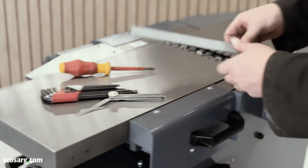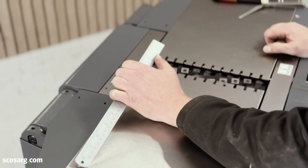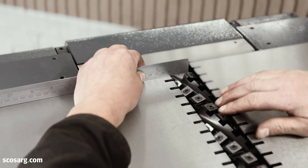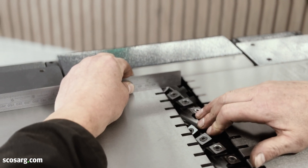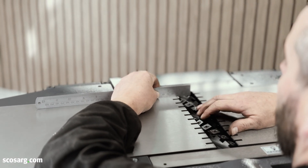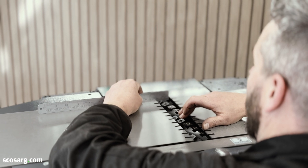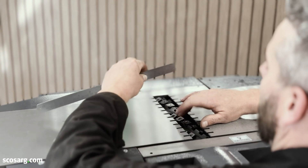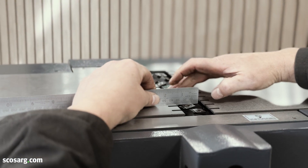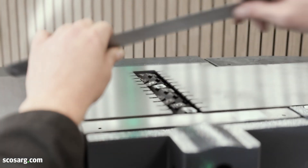To start with, you need a 12 inch rule. Hold it on 30 mil on the edge of the outfeed table, and as you carefully roll the block over, it will grab the steel rule and you'll get a rollover. This one has a rollover of about 3 to 5 mil. You want to make sure these are equal and between 3 to 6 mil. This one's okay.